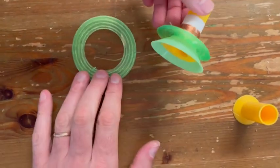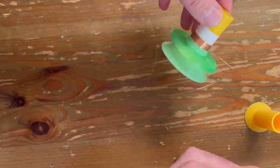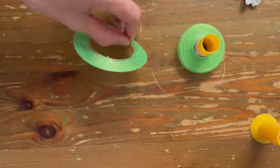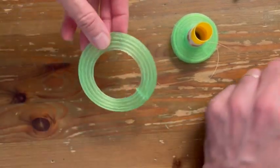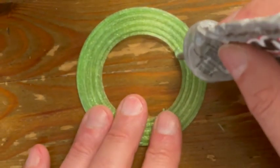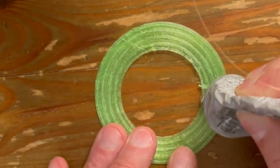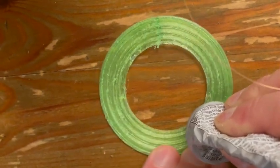Next, what you can do is take the coil, the wire, and the spider with the cone, and you can use this thing over here, which is called the surround. You can glue the cone to the surround. So you have to put glue inside the first lines of the surround.